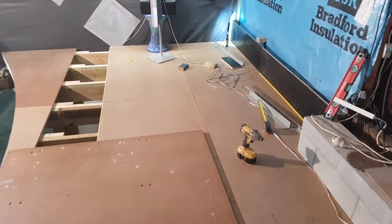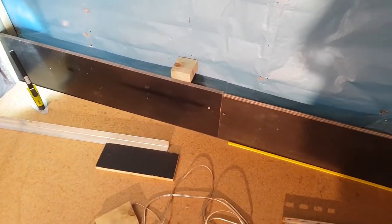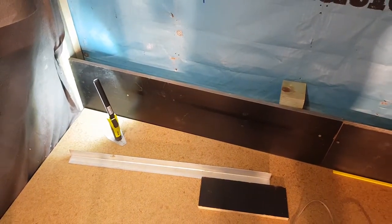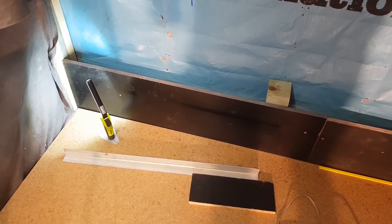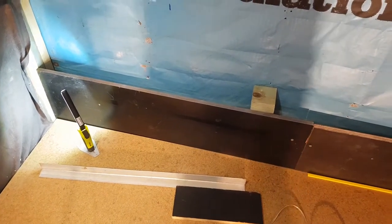And in fact, I do have a bit of squeaking, creaking, and that is basically over the... Remember I chiseled back my retaining wall? You know how I chiseled this back so I could slide this bit of flooring over the top? Well, over here on this corner, it's not propped up correctly. So there's a bit of flex in that flooring, and as you step on it, it might go down a couple of mil, and it's just rubbing against this black bit of form ply, and you get this.